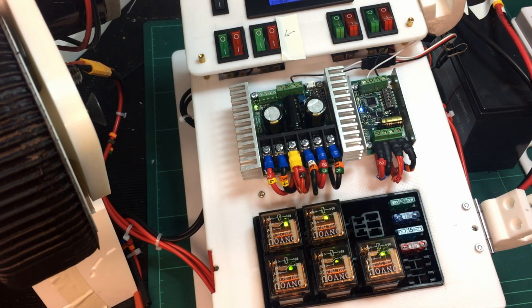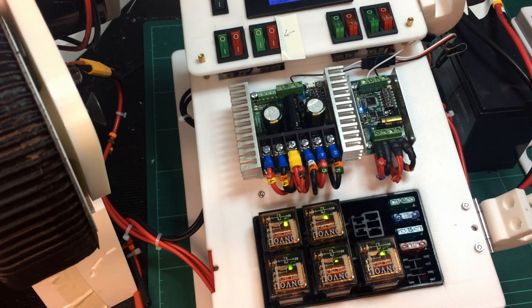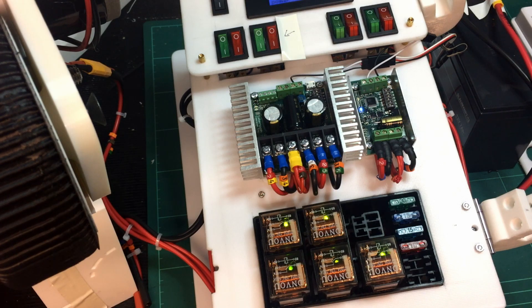I'm running at 9600 baud, which is the slower rate — you can obviously increase the baud rate. The simplest way to do that is to USB connect into it and use their little software program. I'll be controlling the whole thing with a joystick — I've got a Sony PlayStation remote which I'll use. I have actually got that to work in the past with the EZB builder software when controlling servos and various things as a test, and that worked really successfully. I haven't gone that far with this setup yet but I will. With the joystick you can push forward so both wheels go together, and left and right, and this software is set up for that — I think it's actually set up for the Microsoft joystick, but I'm sure I can work that out.